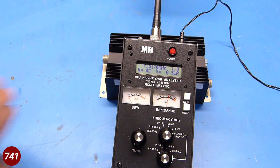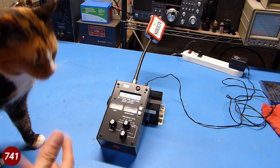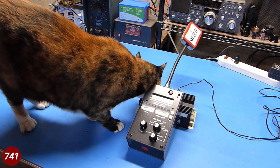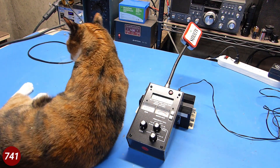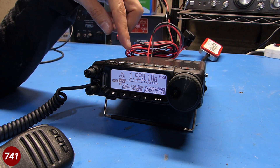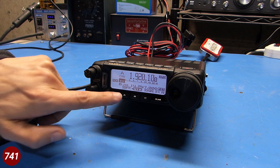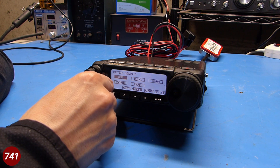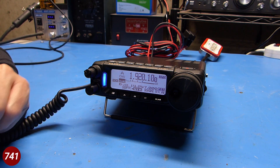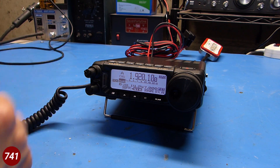Before we grab the radio, the master quality inspector wants to have a look and make sure everything's okay. I've got the FT-891 on the bench with the dummy load connected. Starting on the 160 meter band in CW mode with the meter in power output mode — a quick key up shows we are putting out 20 watts. Switching the meter over to SWR mode and keying up again shows no meter deflection, so this is working as expected. I'll try a couple of other bands and go up in frequency to make sure it's consistent.